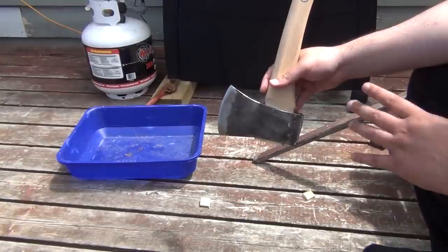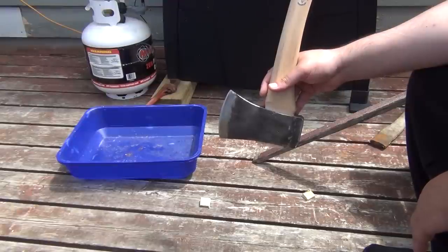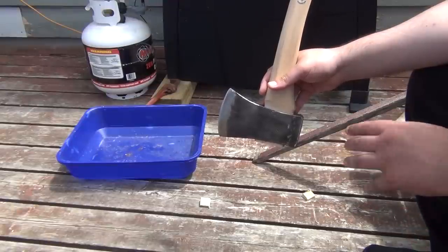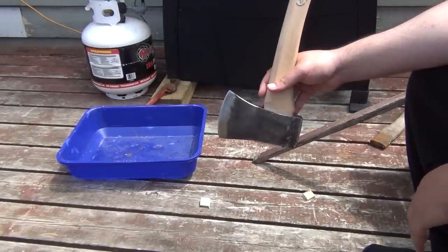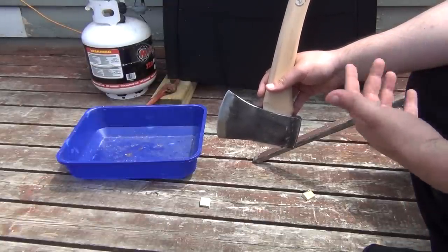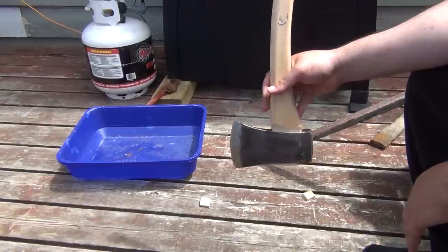Now, that's extremely heavy — it's twice as heavy as I'd normally use for a wood cutting axe. The problem is my friends who are going to use this use it more as a utility type axe. This gets used for sod work and kind of heavy work like that, so I can't put a fine wood cutting profile on it.